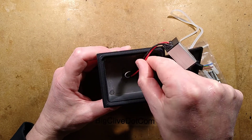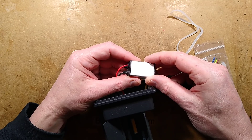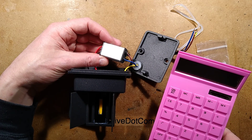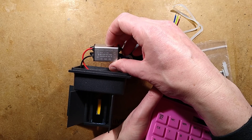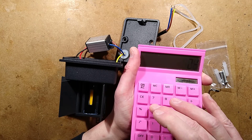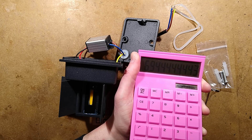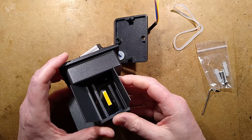What I'm seeing here is the red and black wire going down to the case, going to one COB and then looping out to the next COB, so both COBs are in series. The power supply says 240 milliamps at 40 to 80 volts, 12 to 24 watts. So at 240 milliamps for 10 watts — P equals IV, V equals power divided by current — 10 watts divided by 0.24 gives a voltage of about 41 volts. Divide that by 2 for the voltage across each COB: about 20.8 volts. Divide by 3 volts per LED — that's about 6 or 7 individual LEDs, or pairs in parallel then series.